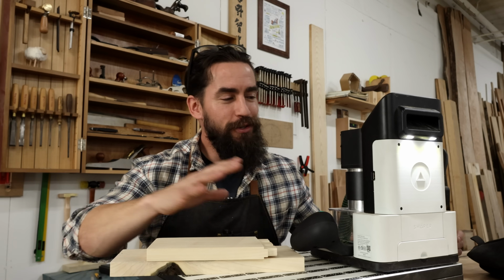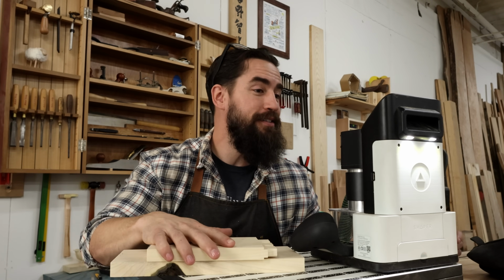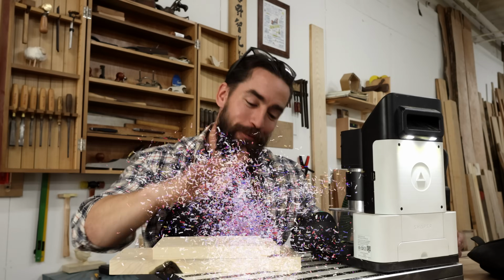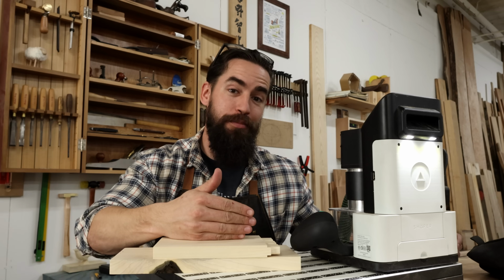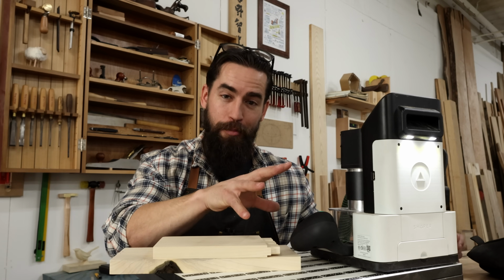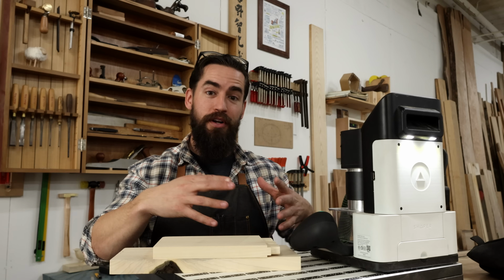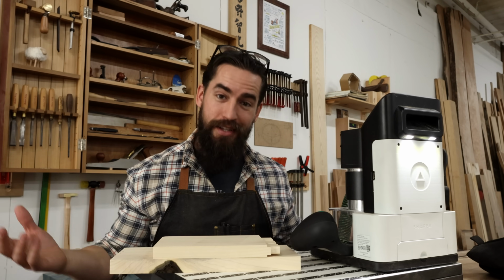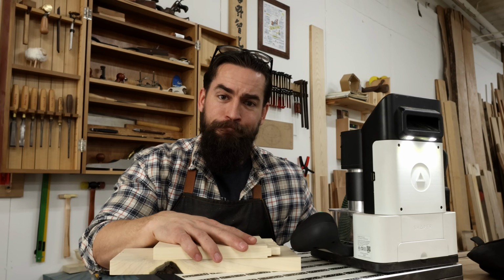But for those of you who do have the origin, one thing to note is, I don't remember what I was about to say. Let us think for a second. There it is. One thing to note is you can use the same file. I don't have to write up a new file. I just drew that file up on Tool, and I'm gonna take the exact same file, copy it and paste it onto my mortise, and just use that. I'm just gonna change from an outside cut to an inside cut, and the process is exactly the same. So, let's get to doing that.